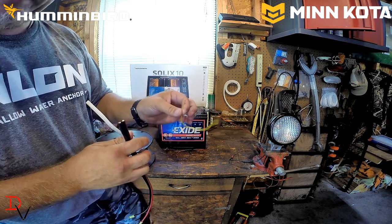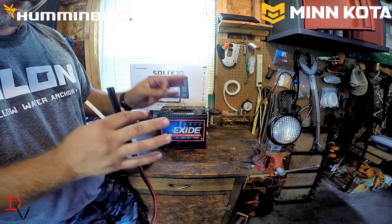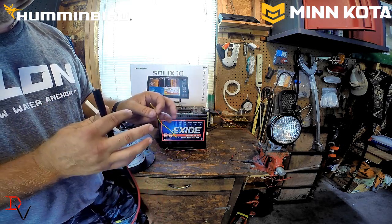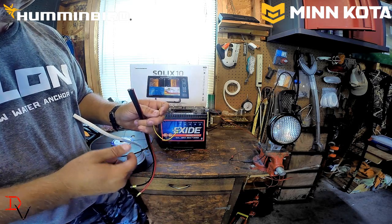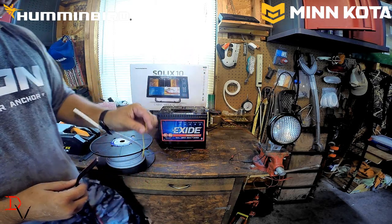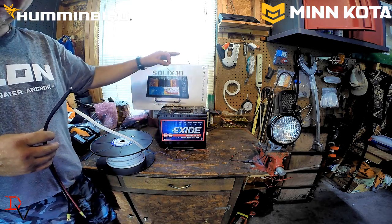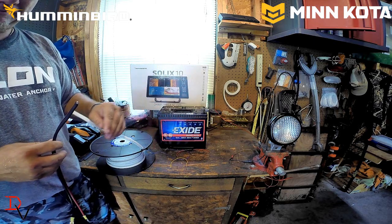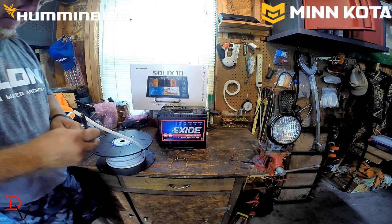hoses. The same reason why your boat and your fishing electronics, the more electronics you put on the boat, the more power that you need to give those electronics. That's why if you start that big motor and the unit powers down or you get a low voltage alarm, it's probably because of undersized wiring from the battery to the unit. As recommended by the electronics manufacturer Humminbird, you should always wire direct from the battery to the unit. You should fuse it at the battery to protect the wiring in the fuse system.